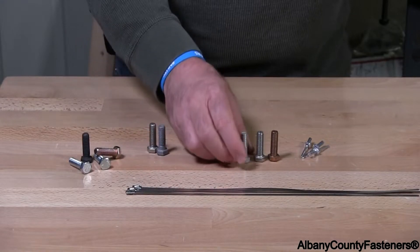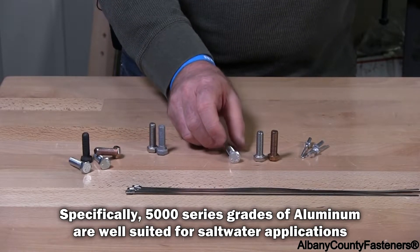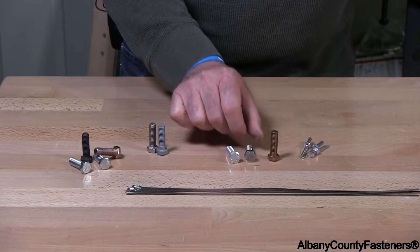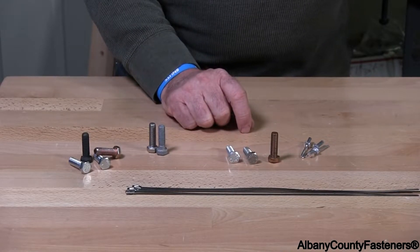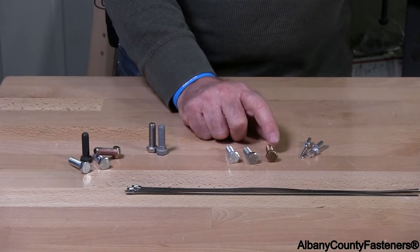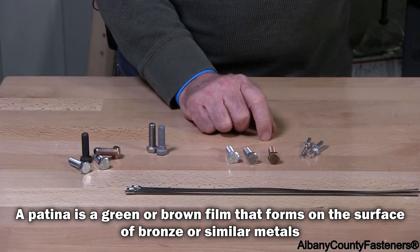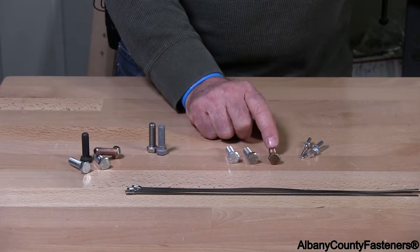I have here all the items that you do want to use. This is aluminum — it can be used in a saltwater environment and will not rust. This is a 316 stainless hex cap screw, which also will not rust in a saltwater environment. Silicon bronze will not rust; however, it will patina over time. It is one of the best items that can be used.